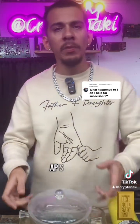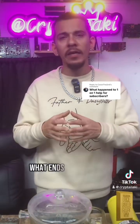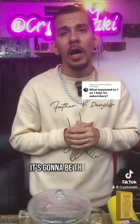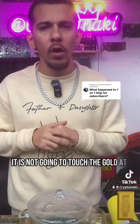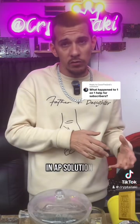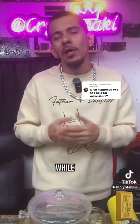When you're using AP solution to recover gold from electronics, the AP solution will go after the weaker metal first — in this case, copper. So as long as there's copper in there, it is not going to touch the gold at all. It takes a lot longer to dissolve gold in AP solution than copper. Copper happens real quick, while gold can take almost hours to a day.